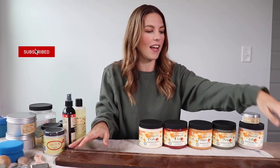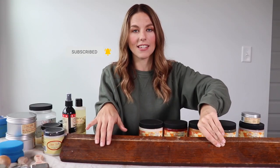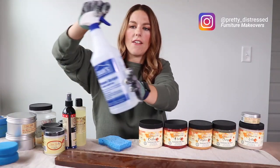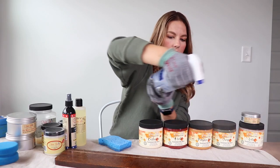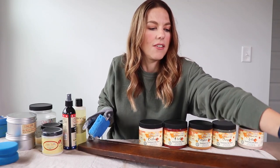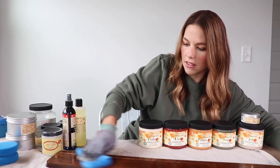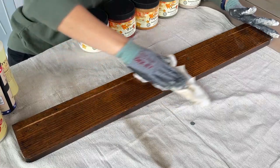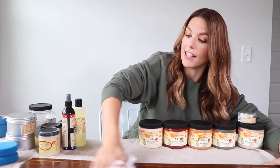Before we can talk about top coats, we need to get some paint down so we can test these out. I have grabbed the back of a board of an old piece of furniture that I took off. I like to demo on pieces like this because this is an existing finish, similar to what you're going to be painting on as opposed to just using a raw board. I'm going to start by cleaning this off with some White Lightening and my sprayer, give it a good scrub so my paint is going to stick really well. I'm taking a towel with just some water to wipe back that residue, then drying it off so I can add some paint.